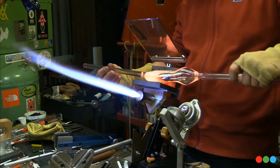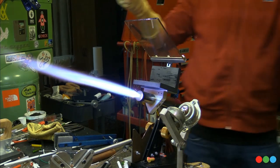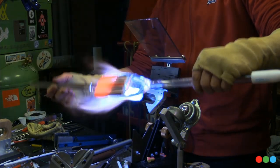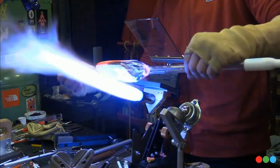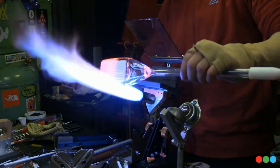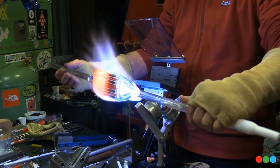Even on my big giant Millie builds, I've rarely used that second roller these days, unless it's super mega and I've got to do a pig roast on it for a while, where I really have to be in the paint. Otherwise, I let that one roller on the blowtube side do the work. It's the same way I work: my non-dominant hand is always supporting all of the weight, and that allows my other hand, the one I write with, to have full control of what's really going on. The other one's just like an engine, and the dominant hand is directing the action and giving me full finesse and control over where I'm at, because wherever the glass is hottest and moving around and requiring full hand-brain feedback, I want that closest to my dominant hand.